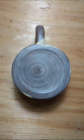The blank from which I cut this mug did not have a crack in the bottom when I started. And in filming this video, I made two mugs out of the same blank, and both of them have an identical crack. And that's not uncommon. This one is pretty small for mesquite. Almost every mesquite mug that I turn has a crack in the bottom. It's also true that every time I've used CA glue and wood dust to fill the crack, it has leaked somewhere along the way. It may take a little while, but it has always leaked, so I no longer do that. I suspect what's going on is the wood expands and contracts with temperature, and the CA glue is just too rigid. It's not flexible enough to follow the wood. And somewhere along the way, it's always going to crack.